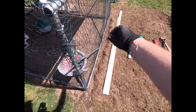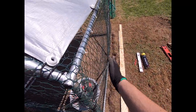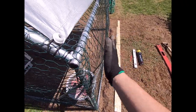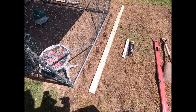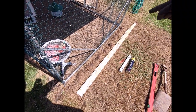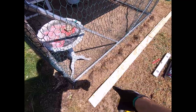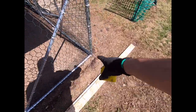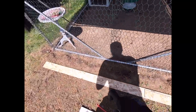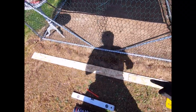The first thing I've done is take my first line off a true reference line — in this case, the chicken run. I'll need to screen behind the greenhouse with sheeting or wood later so sun doesn't shine through into the chicken run. I've set out a piece of wood at 255 centimeters in length, then measured 33 and a half centimeters away from the reference line at both ends to confirm a straight, parallel line. Then I run the line marker spray all the way along to mark that first line.